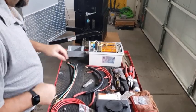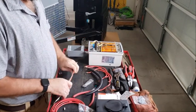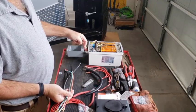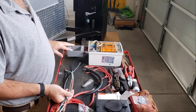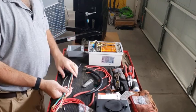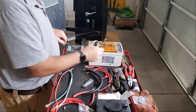So I took the dryer cord and cut off a little extra. What we need are these four conductors out of the dryer cord. I'm going to run them through the three-quarter inch conduit on the transformer, because it's a three-quarter inch hole into the outlet closure box. Make sure you get a three-quarter inch — I grabbed a half inch one first by accident and it's too small.